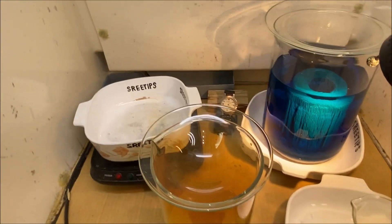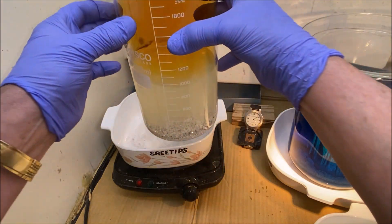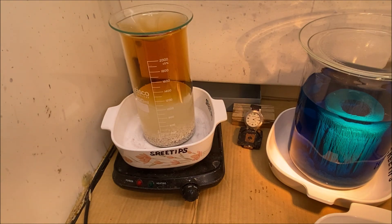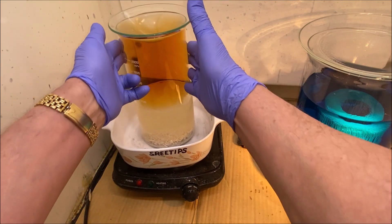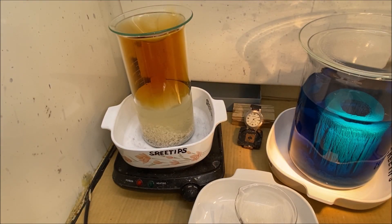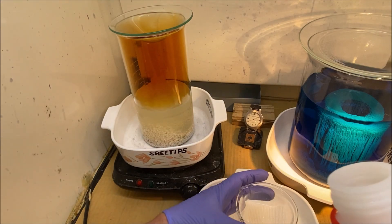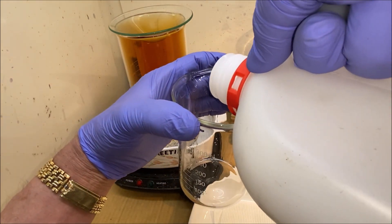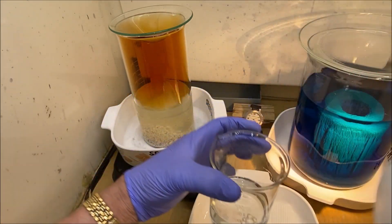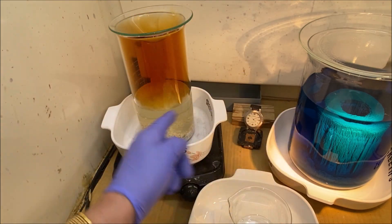You can see there's an immediate reaction. I'm going to cover this up and set it here. I'm not going to put any heat on it just yet — we're just going to let it react. It'll create heat of its own from the reaction where the nitric acid is dissolving the silver. What I'll do is measure out another 150 milliliters of nitric acid and add that in in a few seconds. Then we'll put this on time-lapse.